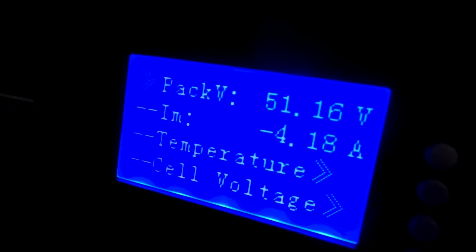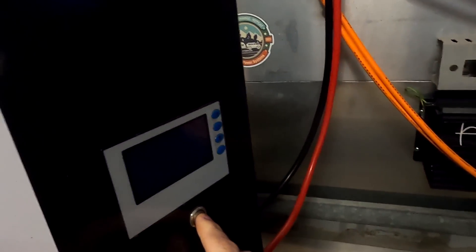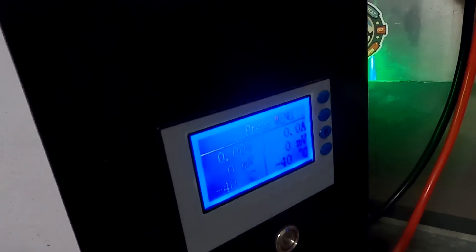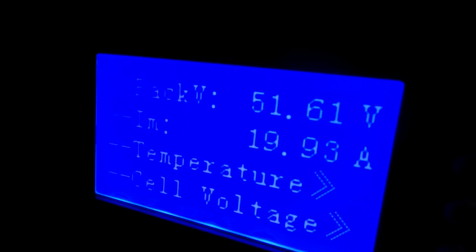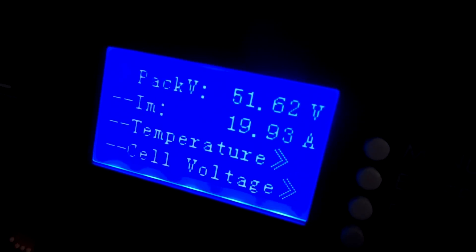Back to the topic - current limiting function. Leave your comments down below about what you think of this safety feature in these BMSs. I actually wanted to show this footage at the end of yesterday's video but the video was already fairly long. I'm still discharging the Jacky battery here at negative four amps. Turning on the QSO battery now - it beeps for a moment and then shows 20 amps only, going into a limiting function. Current limiter - amazing! I'm getting far too excited about this.